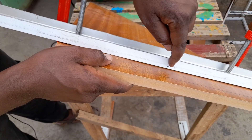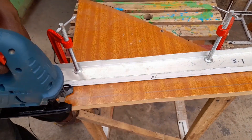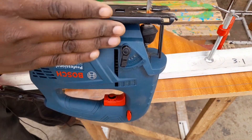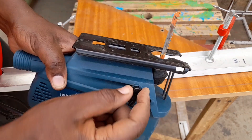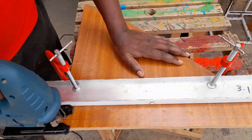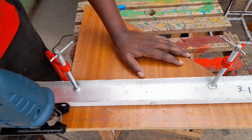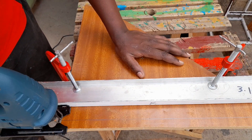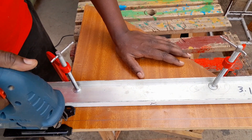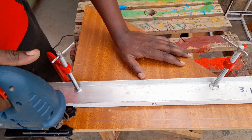Make sure that the height of the bar corresponds to the allowance that you get with your jigsaw so that it has enough clearance — if it's too tall it will be impeded by other features of your jigsaw. Make sure it's on the line, and always power up your jigsaw first, then bring it into contact with your wood. Never start powering up your saw when it's already in contact with the cutting surface, otherwise you'll get a kickback.